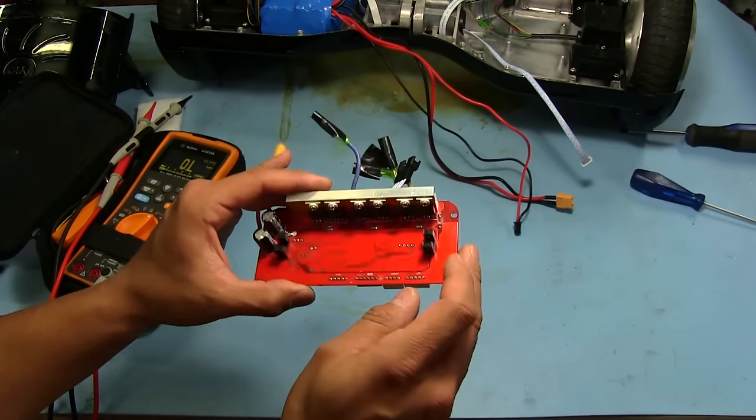All right, so let's hook this back up. This one's marked motor hall, so I'm assuming that's the hall sensors for the motor. Well, I mean, they should be. So we'll put that here. That's where that goes. Hook up the blue to blue, yellow, and they covered it with tape. Oh, and then we've got green. All right, so this one here is the serial connection. That in there. This one here goes to here. Let's plug this motor in. So we got blue. Okay, green. And yellow.